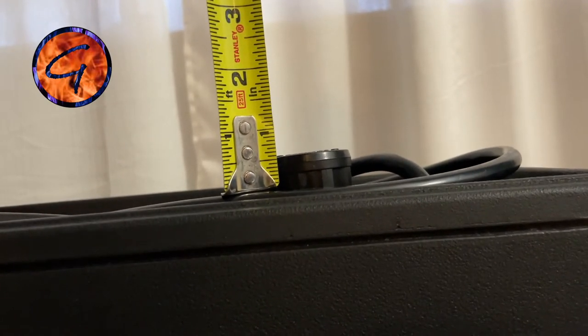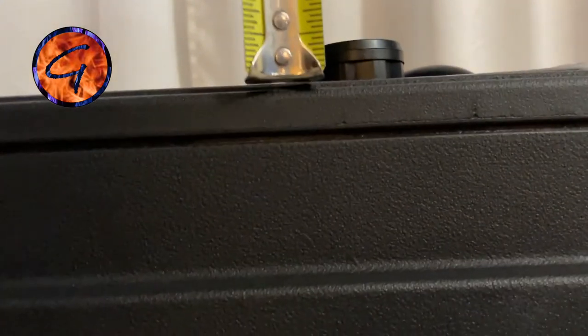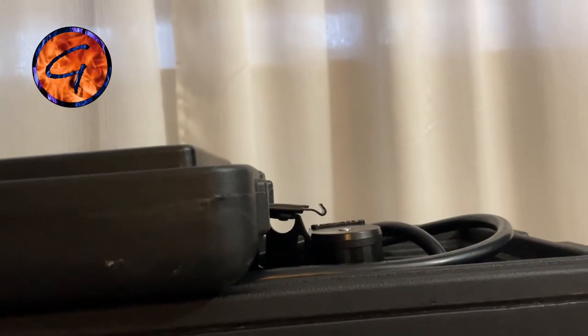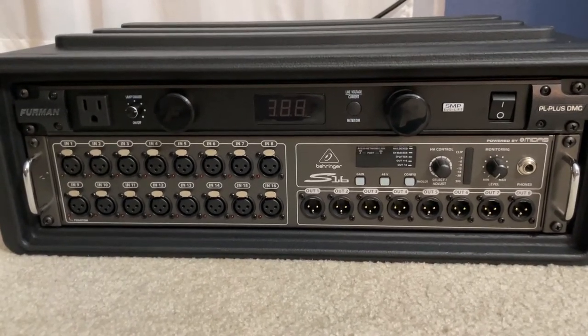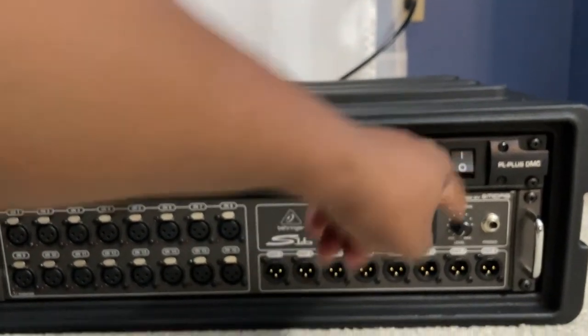This gives a more streamlined cable run wrapping up the excess cable for the power conditioner. To give a reference — how far does that plug stick up outside of the box with the lid off? Approximately a half inch. Looking at how much space we have in the lid compared to how far this sticks up, there's no problem with the lid crushing down on it. It would really be a problem to get all the way to a gig just to find out the plug idea wasn't working, so we're going to test it — it's plugged into the wall, turning on the power strip.